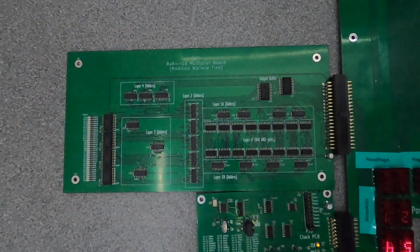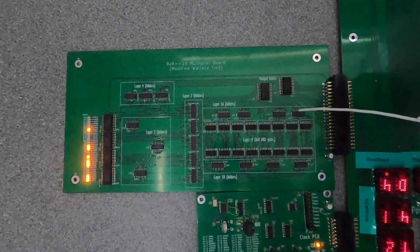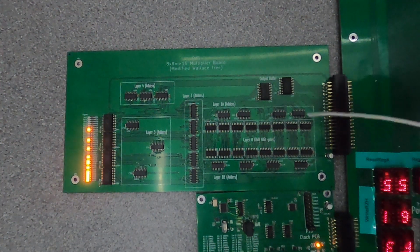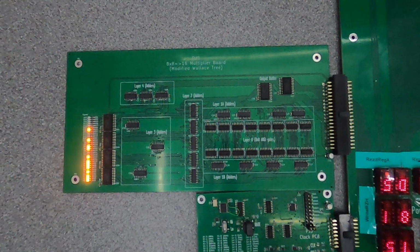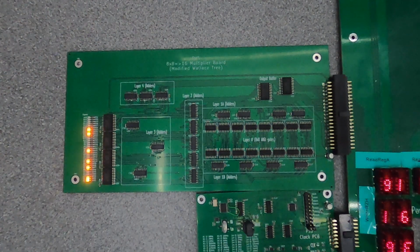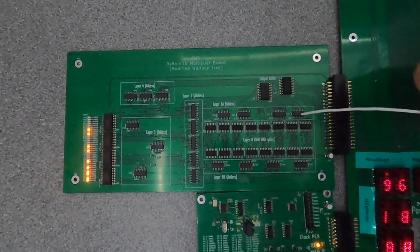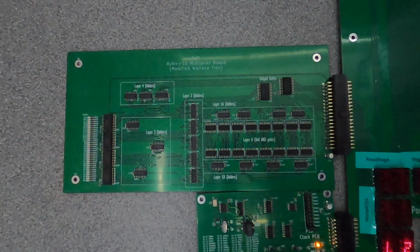And I've very deliberately chosen fast chips here. These are S grade. Actually, I can't remember if they're S or F grade adders, but they're one of the really fast adder families that uses a lot of power, but is also insanely fast. None of this low power CMOS stuff. These are big fast industrial grade. Let's use lots of power chips.